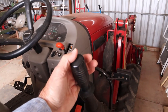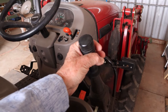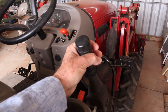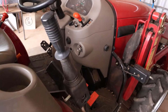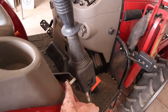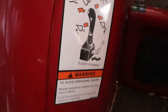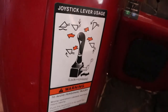Keep your thumb off the jaw button unless you're operating the jaws, because it's quite sensitive — you might accidentally open the jaws when you've got a full load of rocks and distribute them all over the road. There's also a small lever to lock the bucket, and conveniently there's a little diagram on the tractor that tells you everything about how to work the joystick.